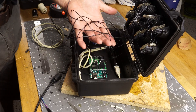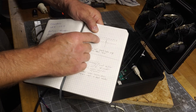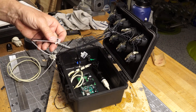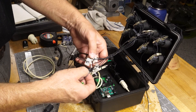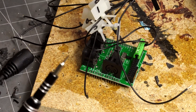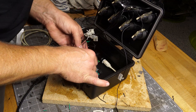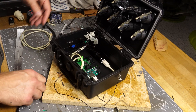I need to figure out where all these wires go and hook them up appropriately. Fortunately, I have these pins mapped out for another project. I'll go to pins two, three, four, five, six, seven, eight for the inputs, and still have the e-stop, and I'll hook the common up as well. I'm wiring this up with screw connectors so I can just plug this into the female headers — hopefully this will work, I've never tried this particular operation before. That's hooked up — just got to solder this on, stick it in, and then I'll have to figure out something with the MIDI.